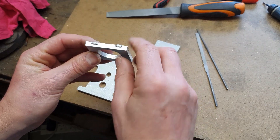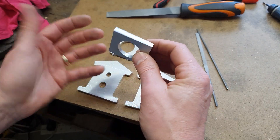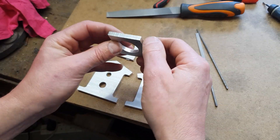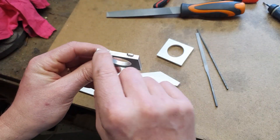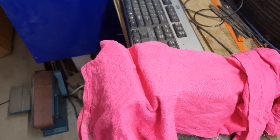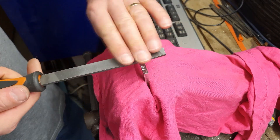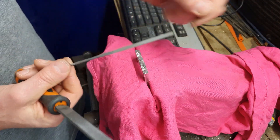We've got one more to do. I'm going to leave these slightly oversized because obviously during the engine build we're going to be taking the engine bits and putting it back together. We might mark these, so I didn't want to have a finish on them and get a mark in there somewhere right at the end stage of putting it together. So we'll put this one in the vise and get rid of these tabs, using quite a rough file just to get rid of the worst of it, then work down until we get to a really smooth file.